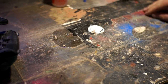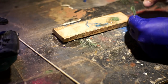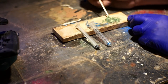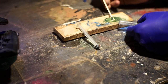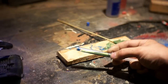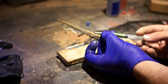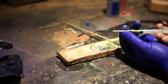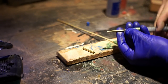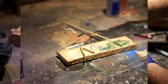For the pins I had to get two different sizes of brass rod for the holes, and I wanted to fill them since I was going to be using it in the kitchen — I didn't want a place for food or grime to get stuck when cleaning it. I decided to use this pearl automotive powder, a metal flaky thing you can get on eBay — really cheap, like two or three bucks for a little baggy. I mix that in with five-minute epoxy, stick it into a syringe, and just squeeze it in through the tube so it all gets filled up.